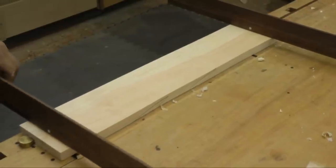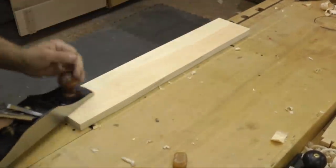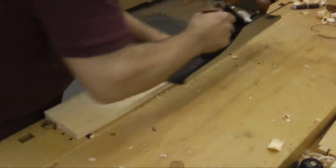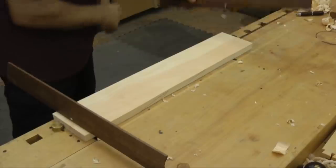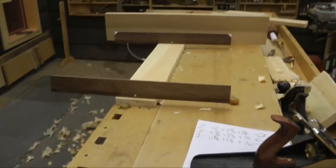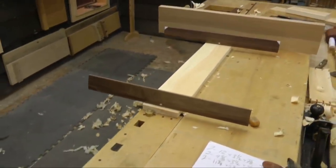They're not pivoting badly — but this one still is. Take one quick pass right down the middle to get rid of any high spot, then another, then off to the left and off to the right. I'm pulling the blade in a little more — I want much finer shavings at this stage. We're getting really close. Dark background in, take the pressure off, sight down — it's really close but not there yet; we're still a little bit high.